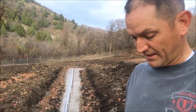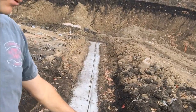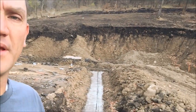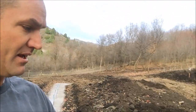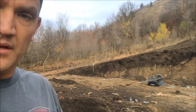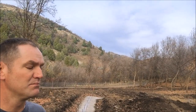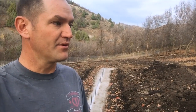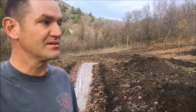I'm really happy we only had a couple of J-bars that were a little bit out of the wall. We're going to end up with a four-foot wall across the front and across the side — this is also going to be a four-foot wall, as well as on the other side. The back wall up against the hill is going to be 10 feet high off the footing, and after grade we'll lose two feet, so it'll be an eight-foot high wall. Between the slab and the back wall I'm going to have about 70 yards of concrete. I've got 12 yards in the footings at about $100 a yard.